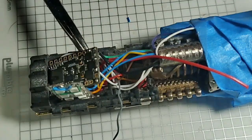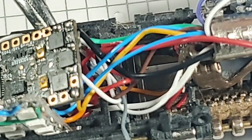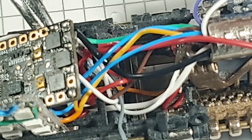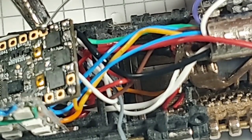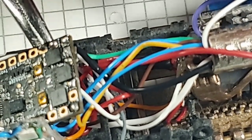you know. So I'm going to zoom y'all in on this, and then I'll point y'all where we're at with the solder. We're on this pad right here, which is our battery negative. So clean off my iron, pre-tin my iron with a little solder, and then we're going to come in here on our battery negative. Shaky hands. Shaky, shaky hands. There. That combed up nice. So I'm going to trim that little bit of excess and hit that with iron again. And I like that.